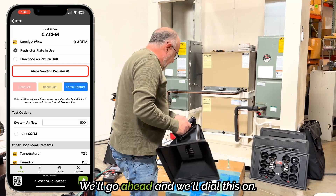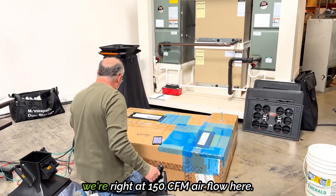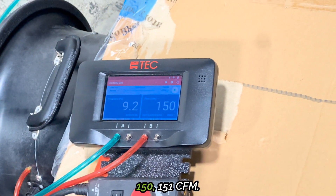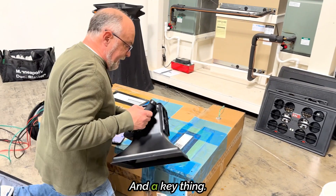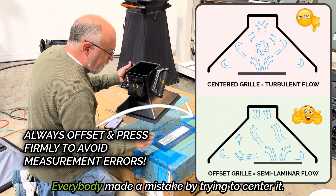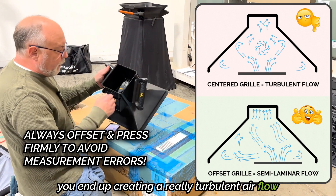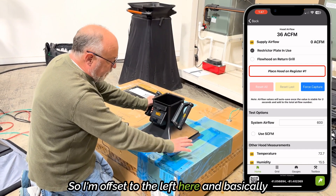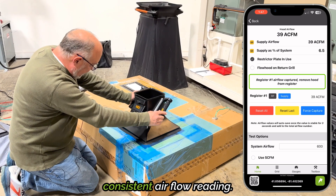So I've got this all set up. We'll go ahead and dial this on. You can see we're right at 150 CFM — 151 CFM. So we'll get our first set of measurements. The key thing when you set this up is you want to offset the hood to get an accurate measurement. Everybody makes the mistake of trying to center it. When you center the hood, you create really turbulent airflow that doesn't allow it to function properly. You need to offset it to the left or right. I've offset it to the left, and basically it's pressurizing the whole hood and squirting the air up through the middle, which gives a very consistent airflow reading.